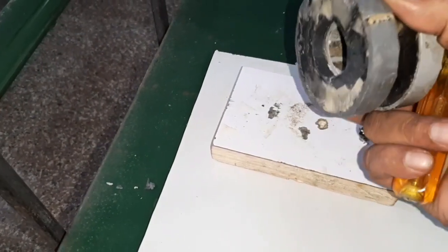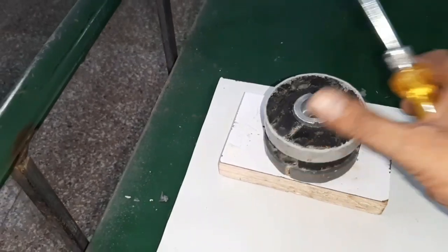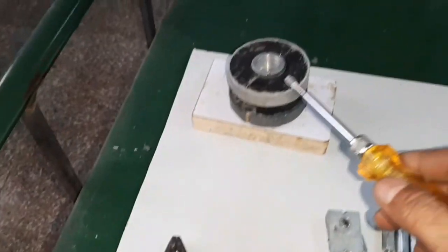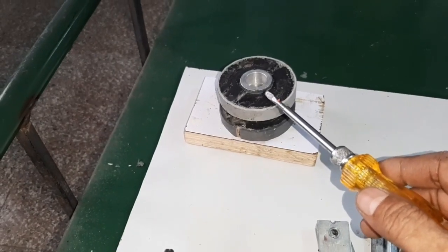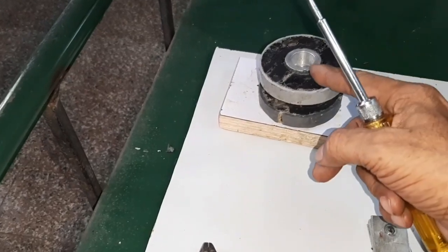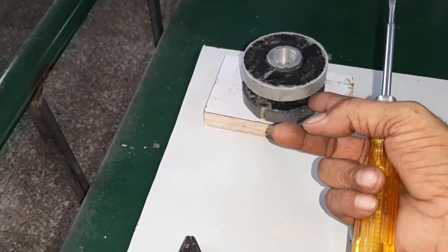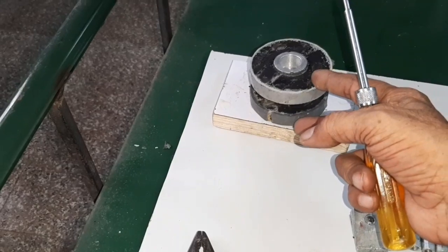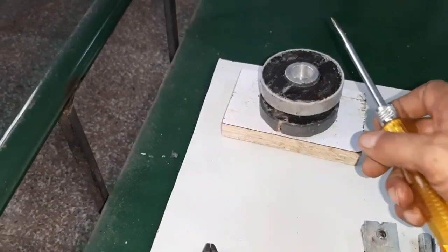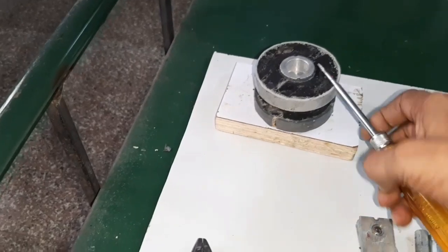These are the two rotors using speaker magnets. The speaker magnet is split into two pieces because the top pole and the bottom pole are not aligned, so it is not used directly for the rotor. In order to utilize the speaker magnet, it was split into 2 semicircles.